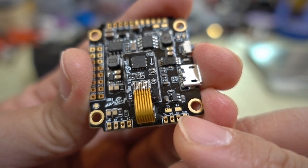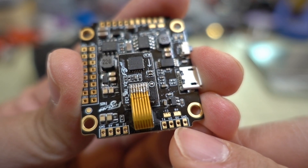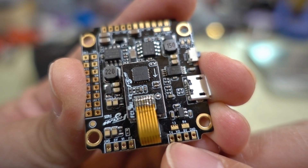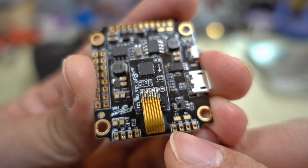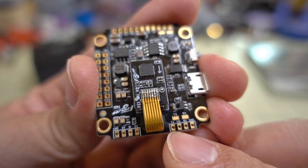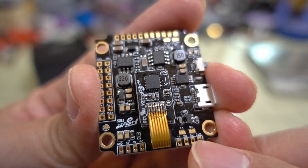On this side is where the 9 volts come out — ground, 9 volts, and video out to your VTX. I think the T4 pad is for Smart Audio, so if your video transmitter supports Smart Audio you'll use that. It's all nicely laid out and ready to go.